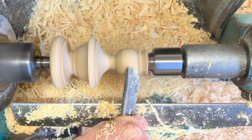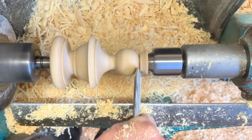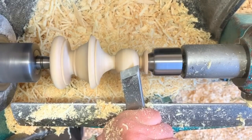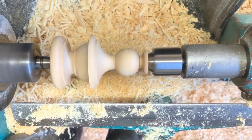As we shape out roughly the ball on the end and refine the shape, always cut away the waste material more than you need so you're not forcing the bevel onto the end of the job. A couple of little touch-up cuts to finish.